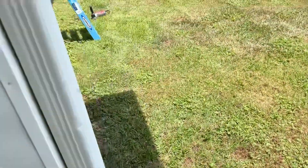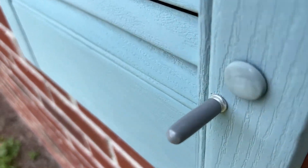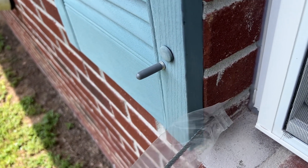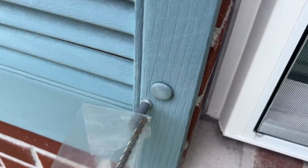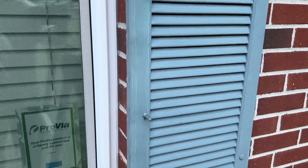Today I'm going to be installing some — well, we've already installed some. If you've got shutters and the homeowners don't want to take the shutters down, you can just pull this little washer right down flush with the shutters. You'll want to start at about the second brick down — you can't be over six inches from the corner. At the bottom, stop one mortar joint up from the last one. If you're using hurricane fabric or half-inch plywood, you set it up on the brick ledge, push it to the wall, bump it with the stoppers to mark it, lay it back down, drill it out, stick it back over, and put the wing nuts on.